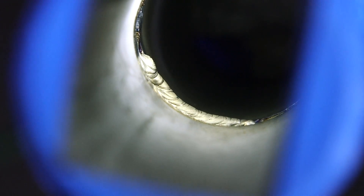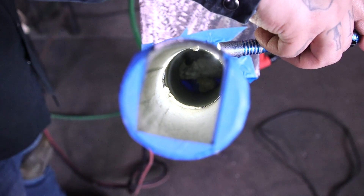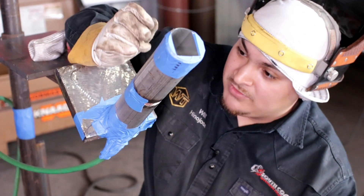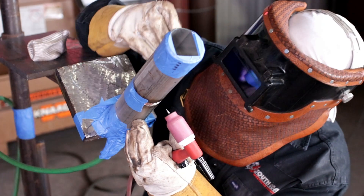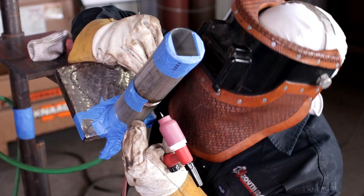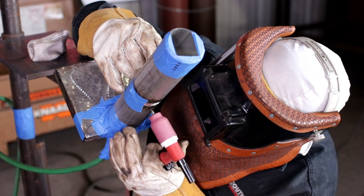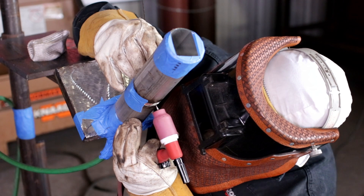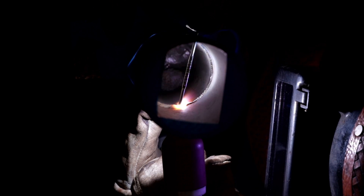There we go. So I just did that right side, or the hard side. Now I'm going to switch over and do the same thing but just with my left hand. Pop the wire through the top. I don't just put the rod there — I'm going to watch it keyhole, and then I put my rod in. Watch it keyhole, just like that. Burn those edges. Hop that wire in.